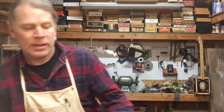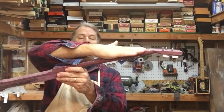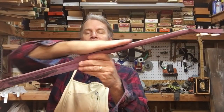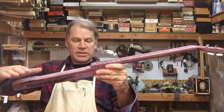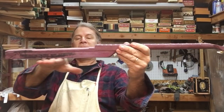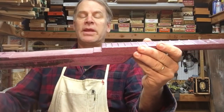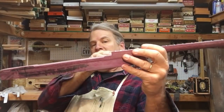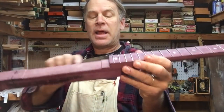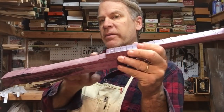Now this is how I achieve that. While I'm building the neck, I have this plane here — the plane of the top of the fretboard, and consequently the plane of the strings — and that's the same plane as the bottom of this heel here. The only thing that's changed is I've cut out more wood here, so I cut it at an angle, and again that angle is going to be about a quarter of an inch fall from the length of this heel.